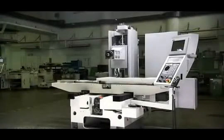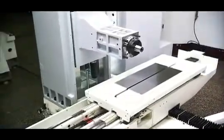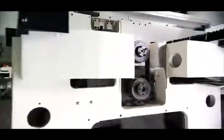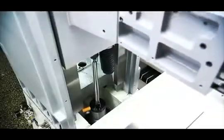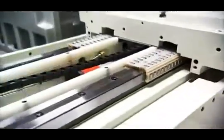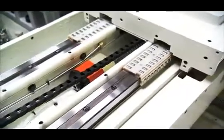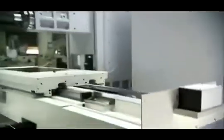The smart series displays supreme rigidity and resistance to flexing, and uses a special design Meehanite heavily ribbed cast frame to guarantee operational repeatability. It also features a counterbalanced headstock for very fast response and supreme downfeed accuracy, and needle roller bearings on the slideways for smooth, low friction, low maintenance operations.